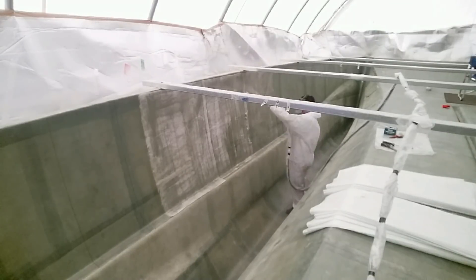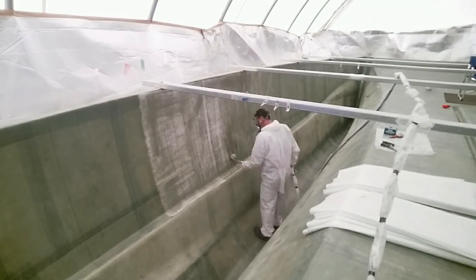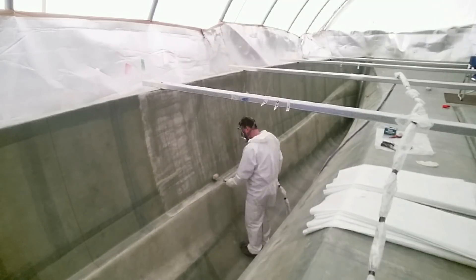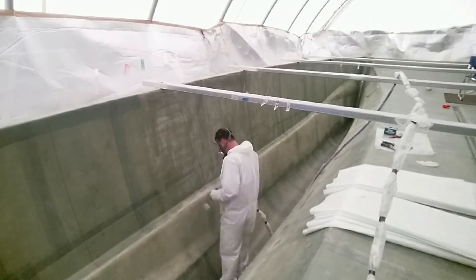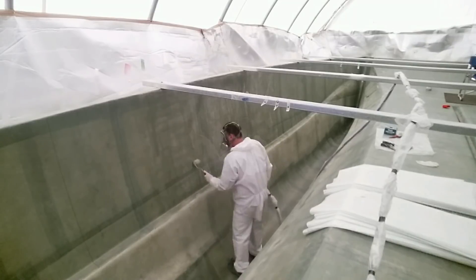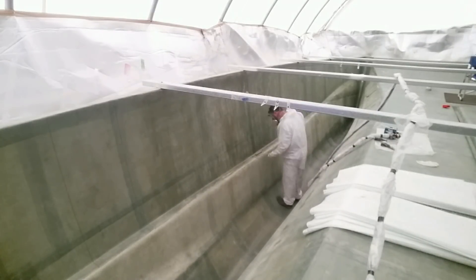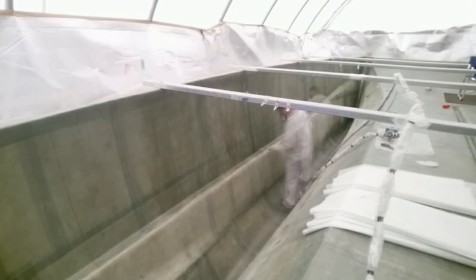The layer I'm applying here is a 300 CSM. It's the final CSM before we put on the foam layer. It was about a good day's work putting in this layer along the hull side, prior to putting in some overlapped flanges that needed to be done as per the plans.